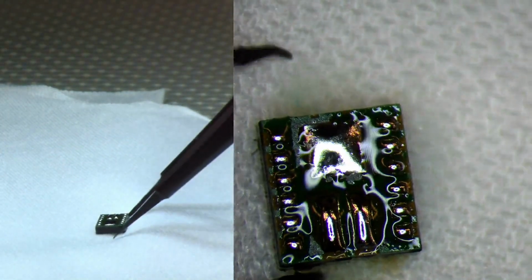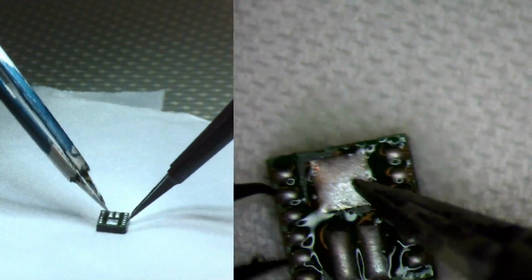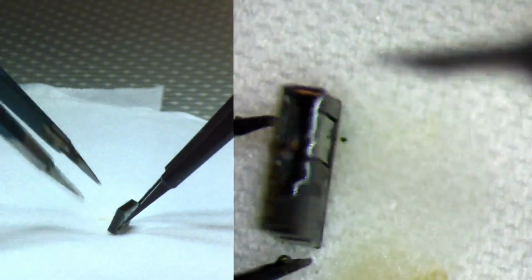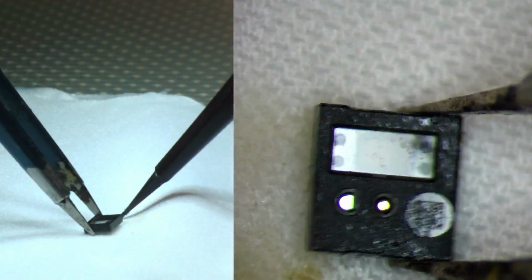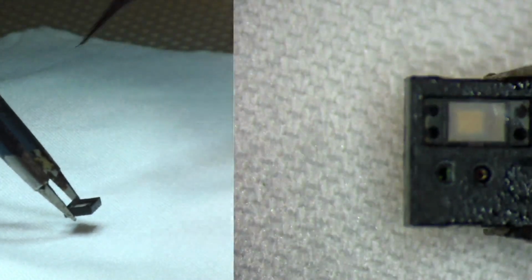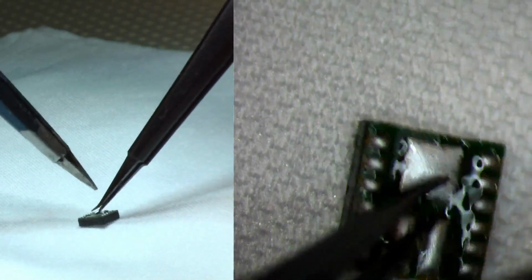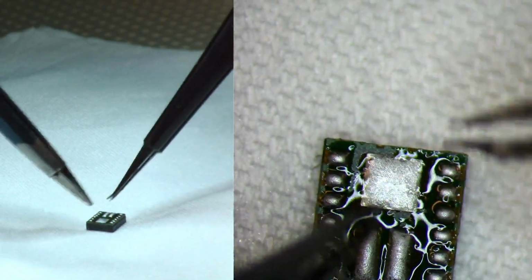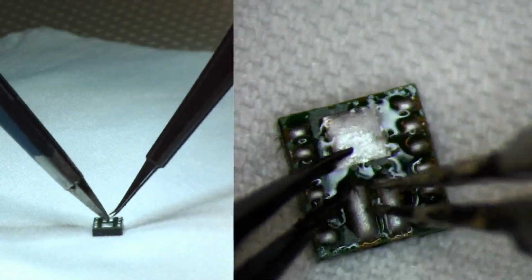So for this particular method, I am going to use a piece of wick to go ahead and remove the, see, let me show you. You don't have like a bunch of flux in the sensor. So that's definitely a good idea to grab a couple clean room wipes. So we'll move it towards another location, because that location already has a bit of flux that's kind of spilt over to the clean room wipe. And let's go ahead and wick this, and then we will reball this.